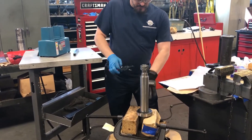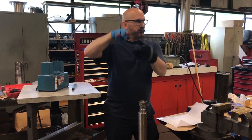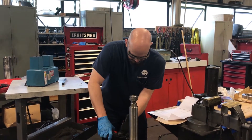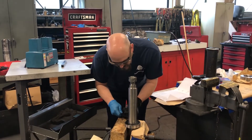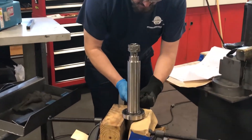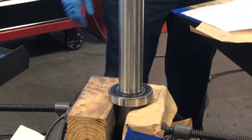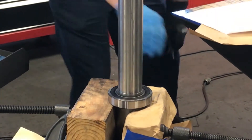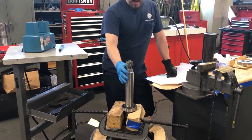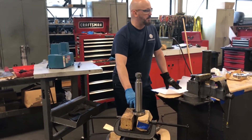For this type of retaining ring, I like to use snap ring pliers that are 90-degree angle so that you can work on the outside. You'll know when it's fully seated in the groove because the whole snap ring can actually spin in the groove. See how it's not getting stuck — I can pull it with the pliers and it will actually rotate because it's already in the groove and it's not going to pop out. The next step is to install the shaft into the bearing housing, because this bearing is going to be the shouldered bearing in the housing.